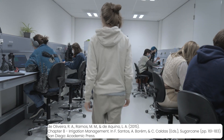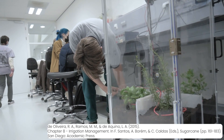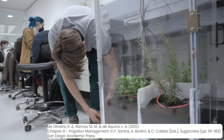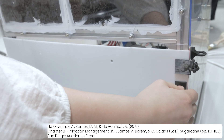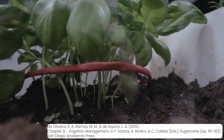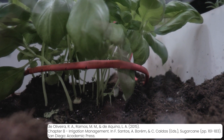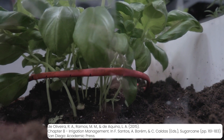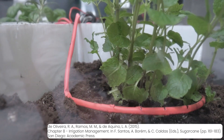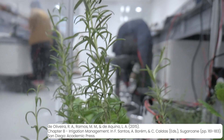Taking the classification from the AI, the current soil moisture, temperature, and humidity sensor readings are compared to our database of ideal conditions for the plant. If there is a discrepancy between the current state and the ideal state, the pumps, fans, and light can be adjusted. Our irrigation system allows each plant to be supplied with its optimum amount of water. If the moisture is below a specific threshold, the pumps start working and pump water into the soil. There are small holes below the soil to drain any excess water, so our plants are safe from parasites that thrive in stale water.